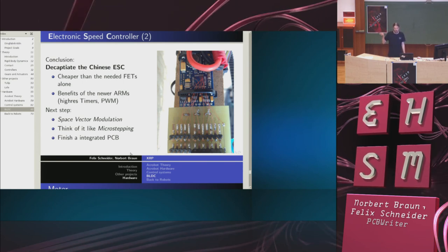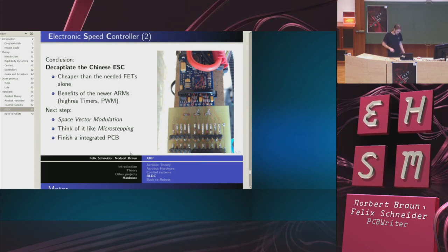Everything is working outside in the hall, and once again, if you have any questions regarding building sensored brushless drivers, feel free to ask. Next thing here is implementing space vector modulation. It's something like microstepping for stepper drivers, but on brushless drivers, and we hope to get rid of the usual snapping you have with brushless drivers, or motors, sorry. And we have to build a better PCB. This one is a bit hacky, and yeah, just...